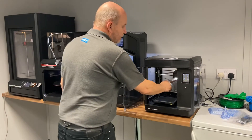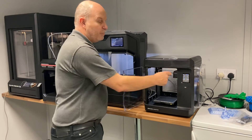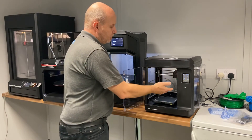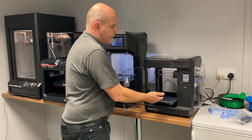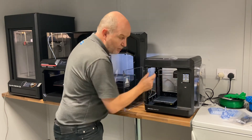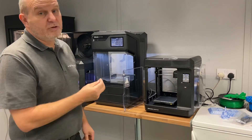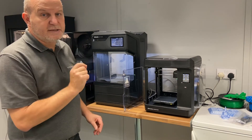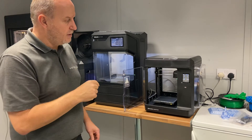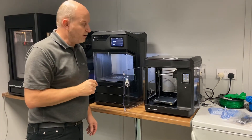One other thing to mention — the extruder. It is replaceable. You just go through the menu, you have to lower the bed and bring the gantry down and forward. Two little clips — pinch it and then the nozzle comes out. A new nozzle goes in, and there are reference details on there for what temperature values you have to put in to set the heat temperature of that new extruder, because they've all got their own individual values.